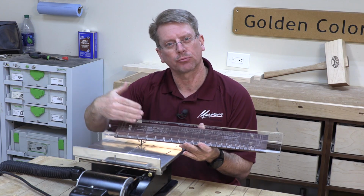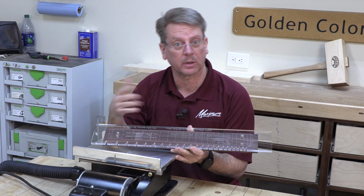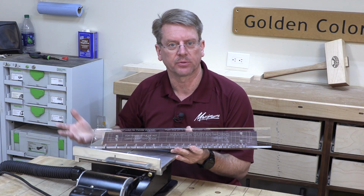So once I have that nut slot area cut, then for each of the fret slots, the pin will be to the right side of the notch within that template, and I'll have all of the correct spacing for this 25.5 inch scale. Now this has 22 notches in it, plus the nut, I suppose, that makes 23.